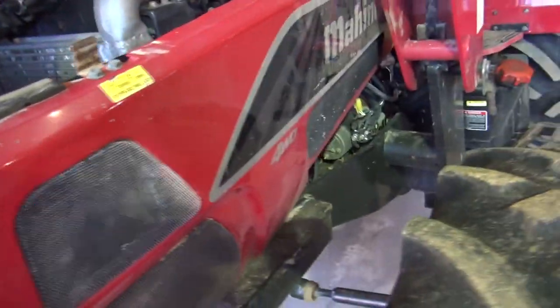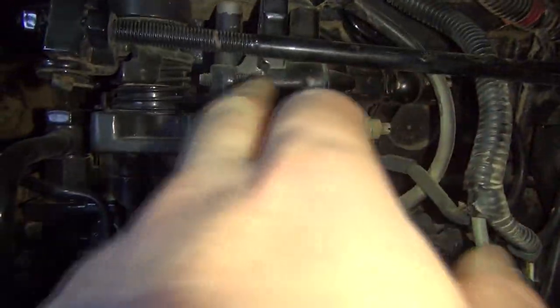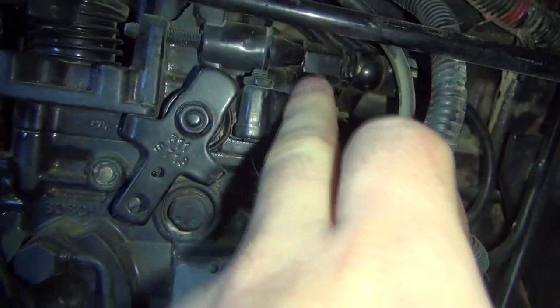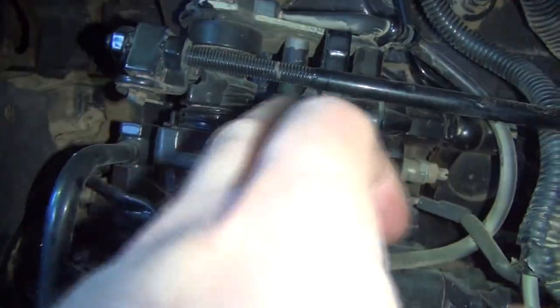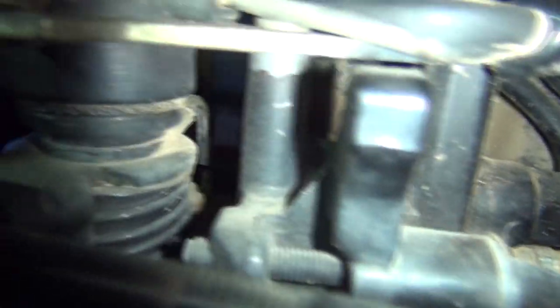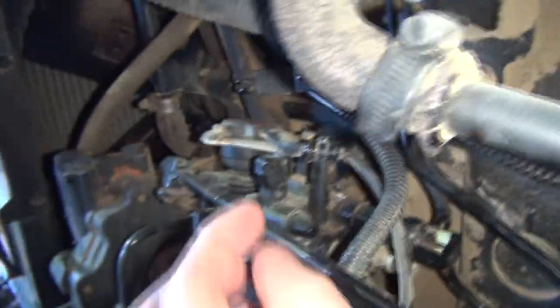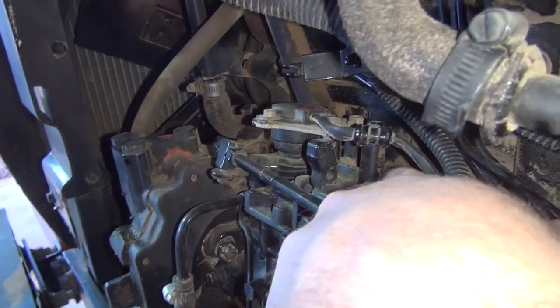I got that side panel off here and I'm going to show you what you're looking at. There's a screw just like this one right here — this is your maximum RPM screw right here. You see this little metal cap on the end? That is to keep you from tampering with it because you're not supposed to be messing with these adjustments. Your idle RPM screw is on the back side — it is back over in behind the injector pump, pretty much straight across from where this maximum RPM screw is at.